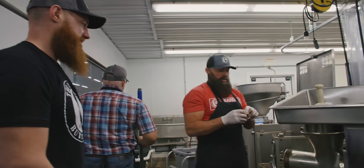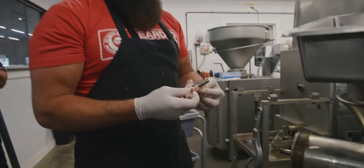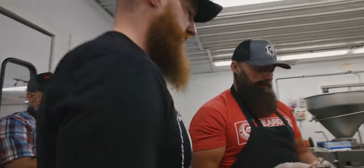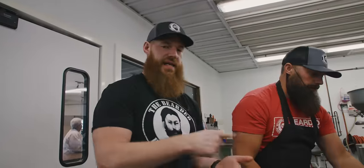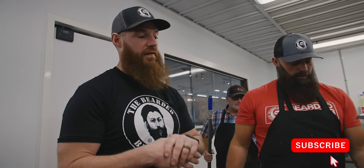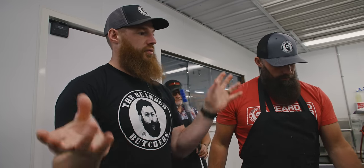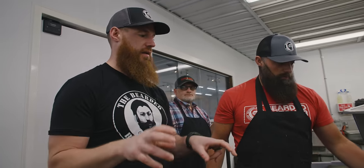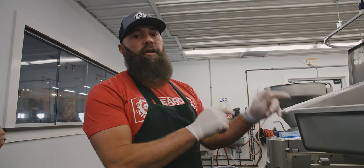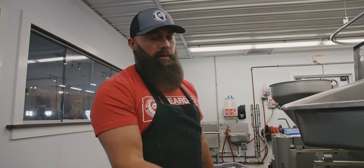But anyway, just real quick, while you're seeing me clean out these grinders, these worms, just so you know, this product right here goes into pet food, so we don't throw it away. Yeah, we do recycle. What he's doing is taking and cleaning out all the debris, because again, you don't want to wash that down your drain, plus your enzymes aren't going to work if you have a lot of heavy debris. So we're going to clean stuff with our fingers out of the nooks and crannies, and then in some cases we spray it down a little bit or scrape it with a scraper so that those enzymes get in there and work. Never turn the machine on to run the product out of the worm. It's a good idea to unplug your machine and pull everything out manually, never turn it on. It's a good way to lose a finger.